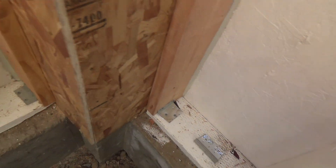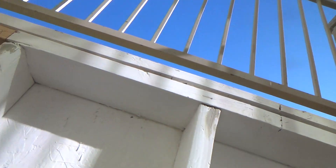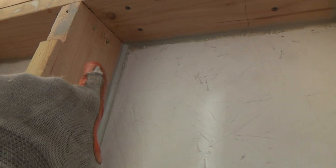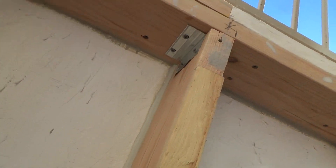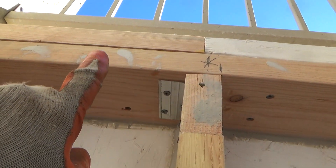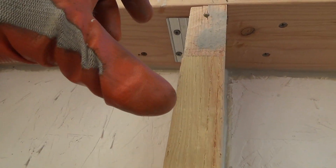We did the top plate — remember to do the top up there. Just ran a nice bead down there and wiped it off. I wiped my finger with any little bits of excess I put up there, just to keep everything nice and clean. Because that's going to be covered with that 2x6 ledger board.